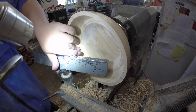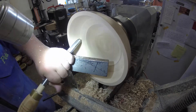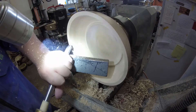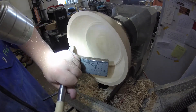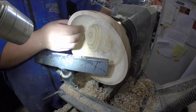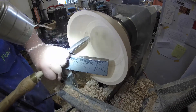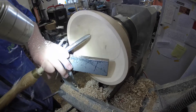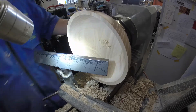This is the American Elm bowl and I've just started cutting the inside. The cut I'm about to make is a finishing cut for the inside of the bowl. I'm just using the left-of-center part on the nose of my gouge, riding the bevel completely, and letting it just slice away the wood. This leaves a really nice surface, but just make sure you do not go any farther than left of center, otherwise your gouge is gonna want to snap down on you.